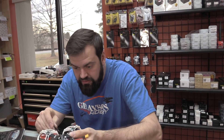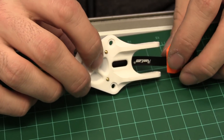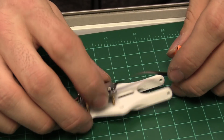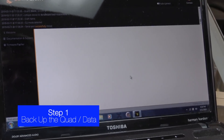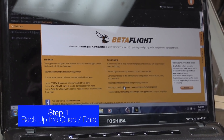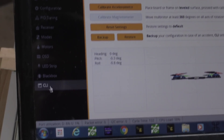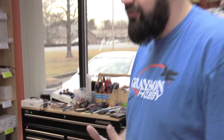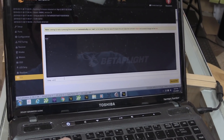No hardware changes. So we're going to go ahead and plug this in. To make it clear, you have to install the camera first — I'm just using this one as an example because it's in its natural state. So here's what you're going to want to do: the first thing is go to your CLI, and because we're changing other stuff, instead of doing just a diff file, in this case I am going to do a dump all. So type the word "dump space all".